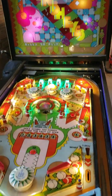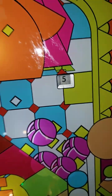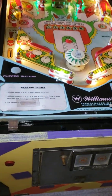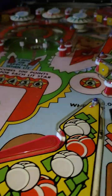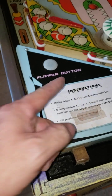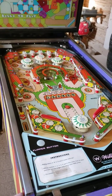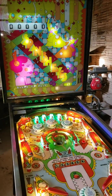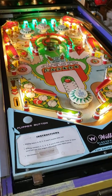One of the things we've been finding is that when we press the start button down below, even though you have credits — if I'm showing that we have five credits — we have no start or we have a false start. What ends up happening is that sometimes we have a bad contact in the start button itself. With these Williams machines, some of these have a flipper button and we have to change that bulb out — it's actually dead. You press this button and it's supposed to light up the machine, but that button wasn't working, so we repaired it. It needed a ground.